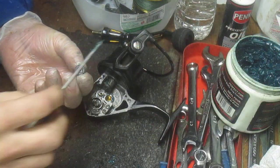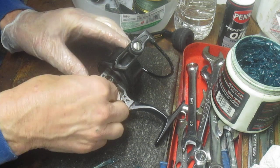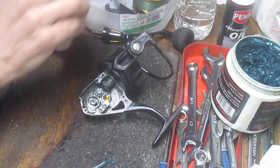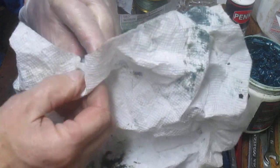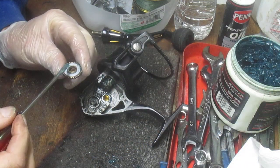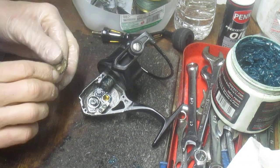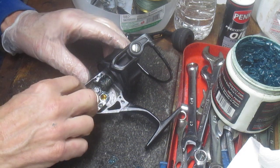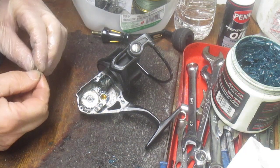This is for stability. Most of the time you'll open up a reel and you'll only see the main gear driving into the crosswind gear. In this case we have two of them — it's just a smoother transition point in the design. We're going to take that crosswind gear and clean it up a little bit. There's some older grease on the back. Now this has got a Teflon washer on it. Typically you don't need to put any grease on Teflon, but it rides on the metal track here, so I'll just put a little bit on — the slip won't hurt it. We're going to make sure that crosswind gear meshes with the top one, which it does. We've tested this and made sure the teeth were okay on both sides.